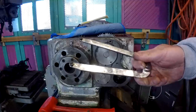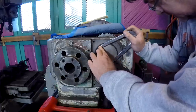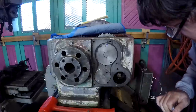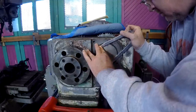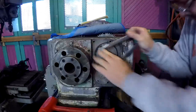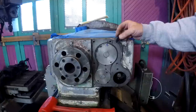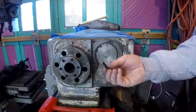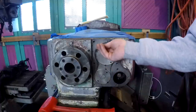All right. Adjustable pin spanner, and the pins are not big enough, but I just thought I'd give it a shot. That baby is not moving. Oh boy, this is going to be fun. Well, it looks like we're going to have to make us a spanner wrench here. A quality quarter inch bolt is a real good fit in these pinholes.